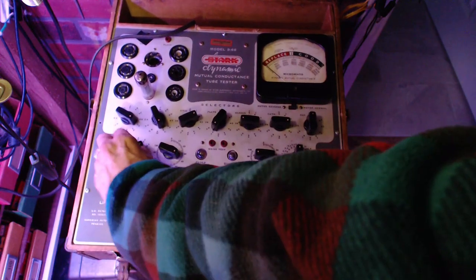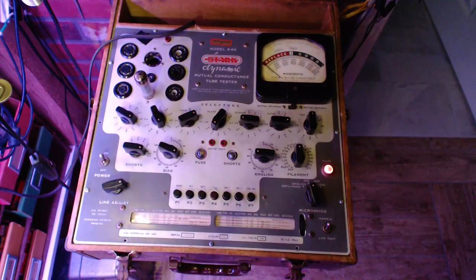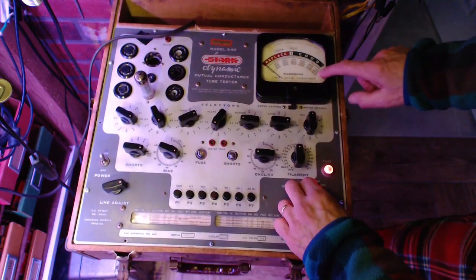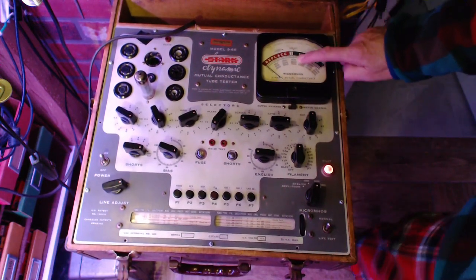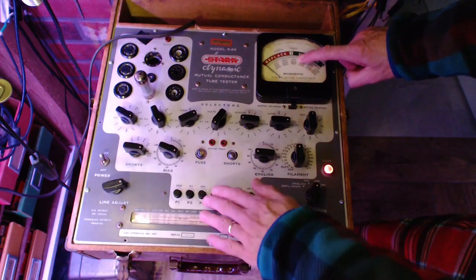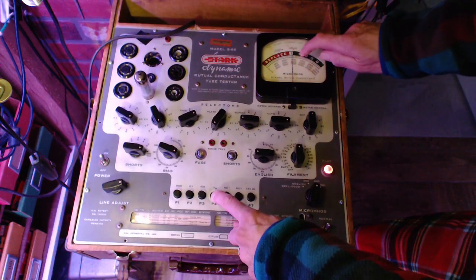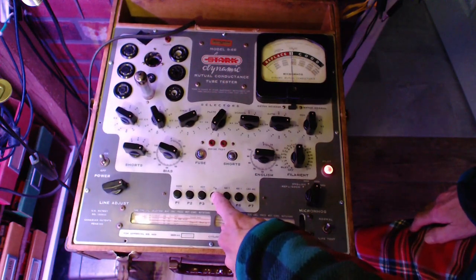There we go. I've already double checked this, I'll do it again. So at P4, whoops, I just need to look at the reference here. So EL86, 3780. It's at 6,000 scale. 37 is up around here. So it's got to get above my finger, or it's a bad tube. And it came up. Can you tell it's falling off? That's another bad sign for the tube.